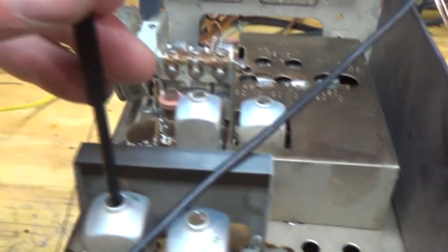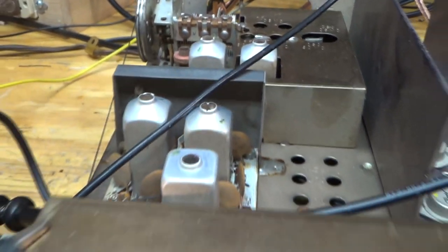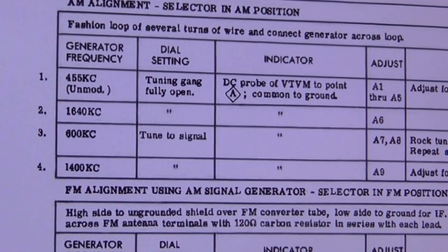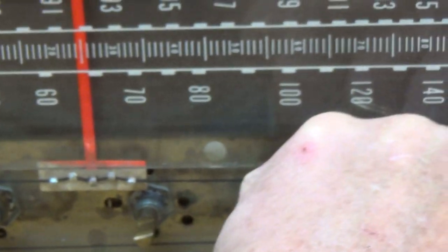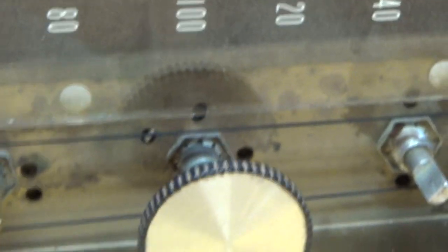That one doesn't seem to be making a difference, which makes me kind of wonder. Let me see if I can figure out how to move that down. Okay, set it to 1640 kilocycles and adjust A6. And then A6 is that center screw terminal there. So A6 is that center screw terminal. So I have my signal generator set at 600 kilocycles. Then I can pick that up. So if I move it a little bit,